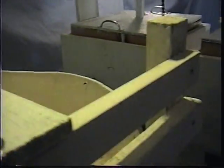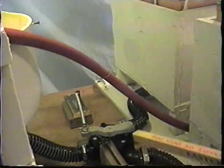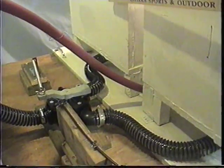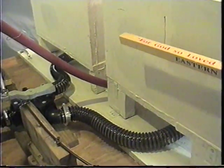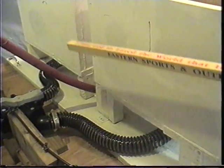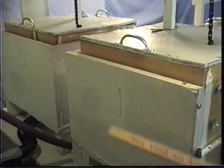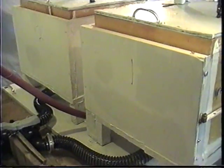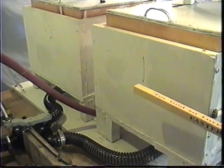As water goes through the turbine and exits the tank, it goes through this plumbing system down here into a Y valve. There's a Y valve here and there's another one on the exit side, on the far side. The purpose of the Y valves is to feed water into the chambers selectively. One is filling and one is draining at all times. So the valve is open for one and closed for the other. The Y valve on the other side is just the opposite. That allows one chamber to fill and the other to drain at all times.